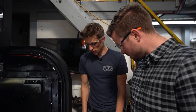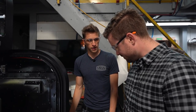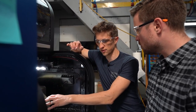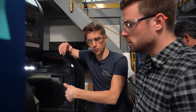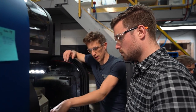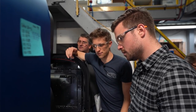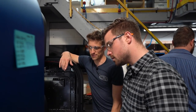So when you're doing setup, one part at a time, you can walk away for a few minutes and be like, one, two, three, four. Ignore the first two or whatever, and then measure. See, the other weird thing with the Swiss is that if you're changing something on the sub side, then the very next part that comes off, you can measure the change. If you're changing something on the main side, you have to make two parts. Because you make your change, you make the part, it switches to here, but another part comes out here, so you have to keep in mind that you have to make two fake parts to test your change. And I've made that mistake too, like I make a change over there, I make one part, and I'm like, it didn't change anything.